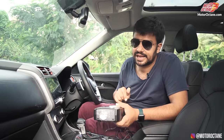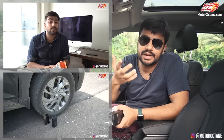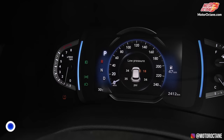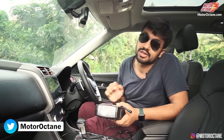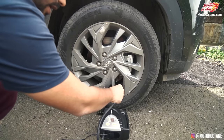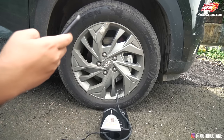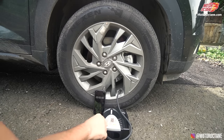Back here there are more details. So I'll connect it here and start. I will push the pressure here by setting this to 34, and with some vacuum it will start. The pressure shown here on the meter is 18, and I have to make it 34. So you will see how much time it takes to go from 18 to 34. Let's go and see.